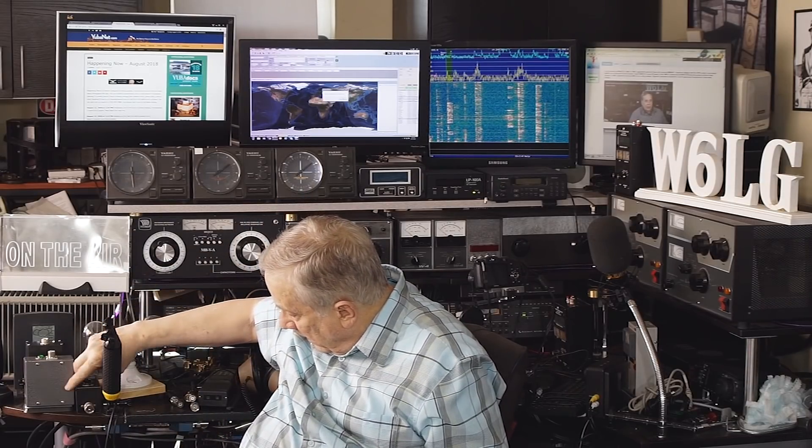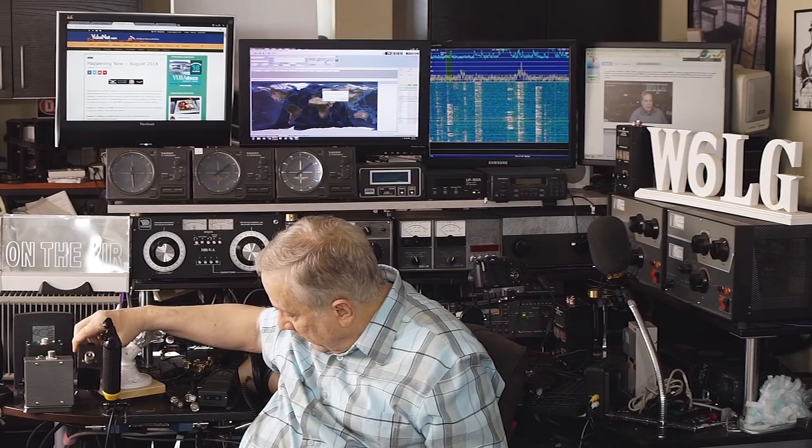If you see this meter, or here's one — an old SWR meter — this does have a field strength meter built into it. It doesn't have a lot of use as an SWR meter, but the strips inside will pick up the forward and reflected voltages. There are a couple of diodes that rectify the voltage coming down the whip, and it actually works pretty good.